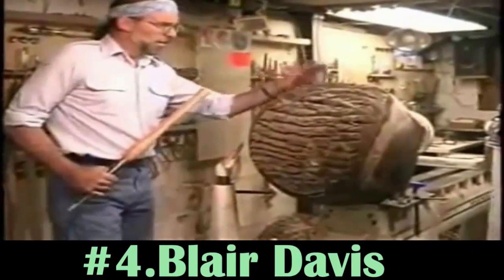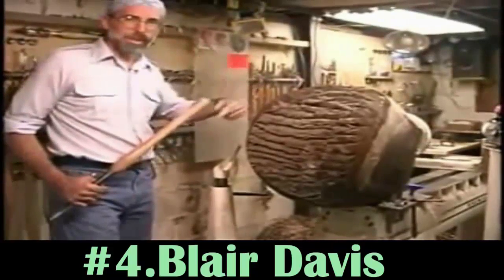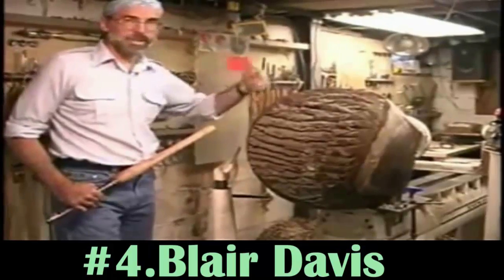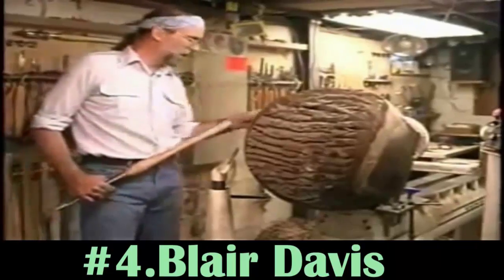If you could hear that, but as you start to get closer to round, the sound that the lathe makes as it comes around, that sort of ripping sound of the cut gets longer as a percentage of the turn. Then you know you're getting a little further down and less choppy.